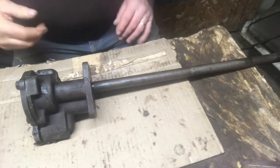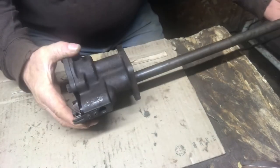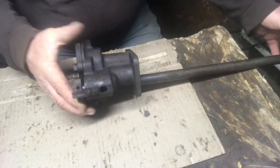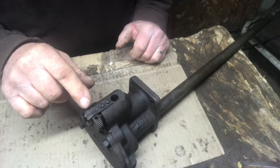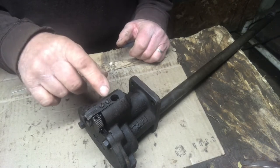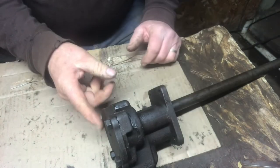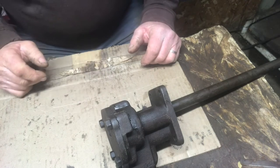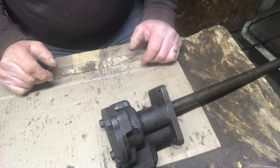This is the oil pump for my 60. I was debating whether I would even disassemble it because it wasn't in the least bit sticky — you can hear oil inside of it. The only problems I could picture having with it: this is obviously some sort of a pressure relief valve, so I want to take that apart to make sure it isn't stuck tight. It might be keyed or pinned — the drive gear on the shaft inside — and I want to inspect that. So I'm going to start disassembling the oil pump.